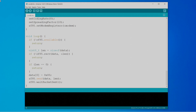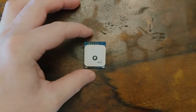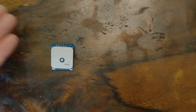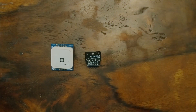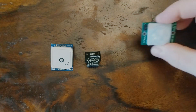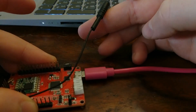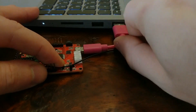For the transmitter, I'll have another Maduino LoRa board reading from one or more sensors and sending the readings over LoRa. The sensors could be anything — if the device is on the go, it could be reading GPS coordinates for remote tracking, or reading temperature and humidity from an environmental sensor, or you could make a remote security system that sends a message whenever an infrared motion sensor is triggered. There are a lot of possibilities. Just remember that the sending node should set the first byte to be non-zero so that receivers know the message isn't coming from the repeater.